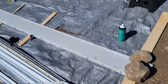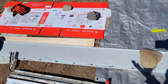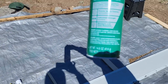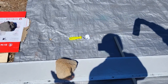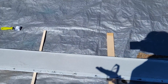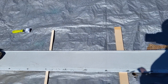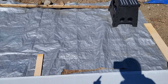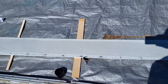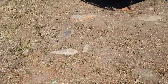We just put the aluminum skin back on one of the pieces that I had already finished. We used 3M spray adhesive to adhere it to the wood, and we've got rocks in place to hold it down while it dries. At the joints, there was nothing to tie them together, so we bought little Simpson ties and screwed the pieces together for more strength. Once the other end is in place, we'll put the end on.